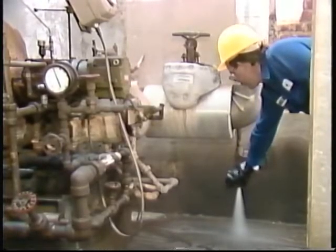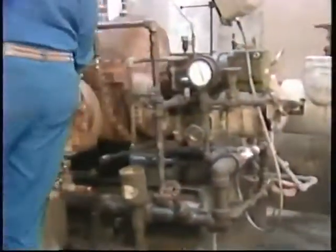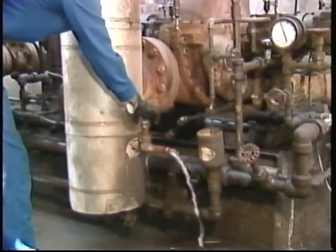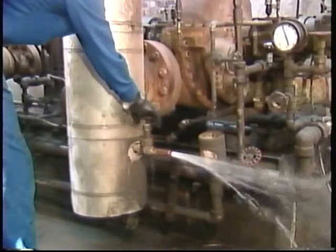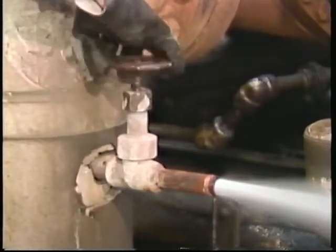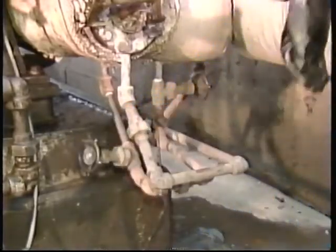One especially important preparation for virtually any steam turbine is to completely drain any condensate from the turbine and its lines before startup. High-velocity slugs of condensate on the rotor during operation can be very dangerous and damaging. To drain the turbine, open the drain valves for the inlet piping, the casing and steam chest, and the exhaust line piping.